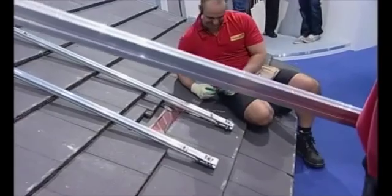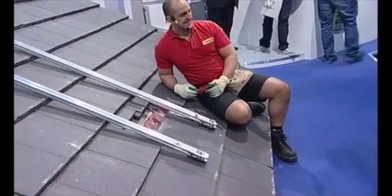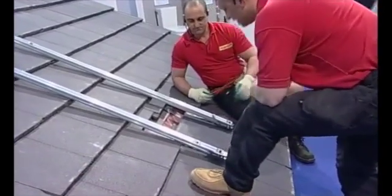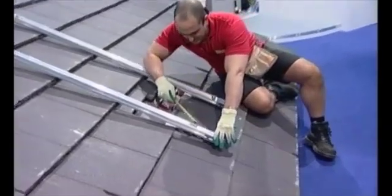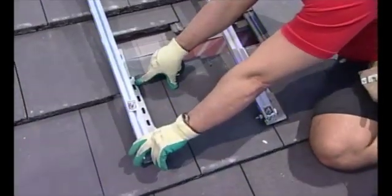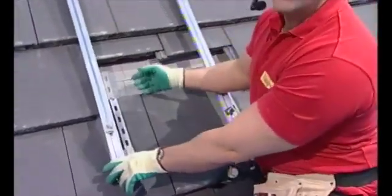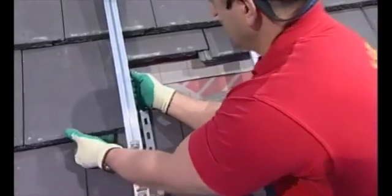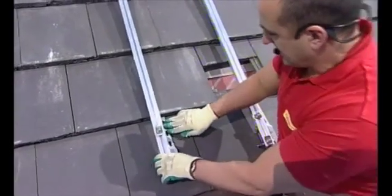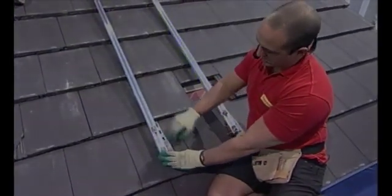Because we need to attach something to them so we can screw it to the roof. What happens then is, to that bar, we'll connect these straps, which are what holds the solar panel into position on the roof. You can probably see this strap here goes underneath the tiles — it's very thin, but it's stainless steel, and then it's screwed to the rafter. We bring this tile over the top, and that tile goes down, so you can see that it is then watertight, and the bracket continues to come up and holds all this into position.